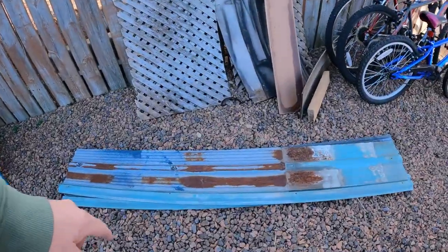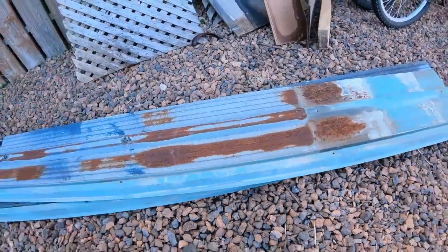So before I head uptown to get another box, I'm gonna screw these pieces here for the edge I told you about. Let me get those screwed on, because I do have enough to do that. I'm going to come back. It's just a matter of screwing things down where there are no screws. Now I'm going to put the ridge cap on, which I'm going to make out of the long pieces there. You can buy a ridge cap, but we're a budget DIY here. So we're going to cut us a ridge cap, and we'll see how that works.